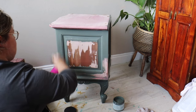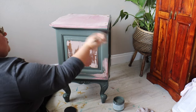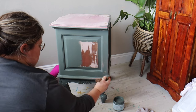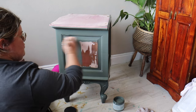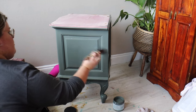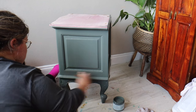As you've noticed, there are areas of my previously painted finish that still have paint on them and areas that have been taken right back to wood. That's just how it came off, and as long as it's smooth to touch you are fine to repaint over something that is already painted. I know that the piece was already stripped back to bare wood before I painted it the first time, so I don't need to strip the Terraclay paint right back — it's fine to go over the top of it. As long as it's smooth to touch with no flaky areas, you can sand any texture smooth and go straight over the top.